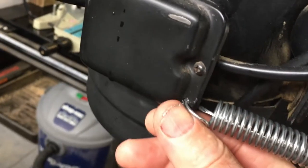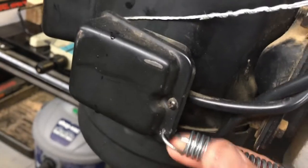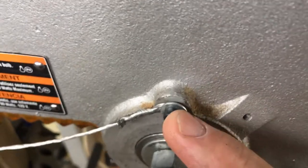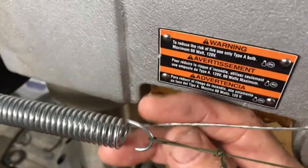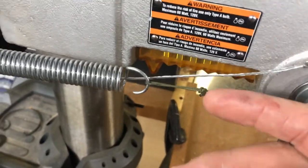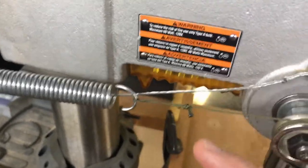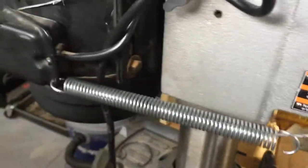As far as where the spring is attached, all you do is drill a small hole on your electrical box here — that thing is mounted really strong, probably at least two screws in there, so it's not going anywhere. This cable here is your safety cable, just like a garage door opener. I wrapped one end around where there was a nut for the housing and put a flat washer so it wouldn't come off. Then it goes all the way through the spring and comes around the backside of the housing and wraps around there. In the event this paracord were to break or the spring were to break, instead of the spring flying back and hitting you in the head, it'll just come forward a couple inches and stop because it's got this cable inside it. So you've got a safer setup here.